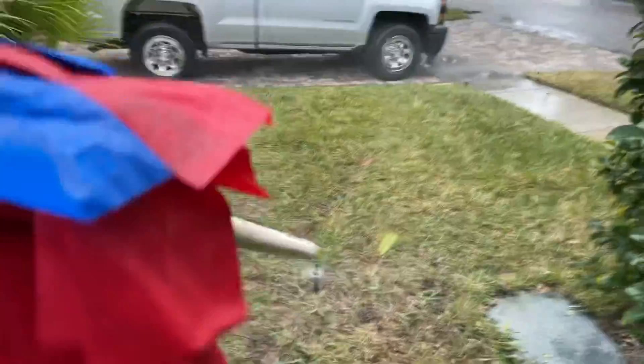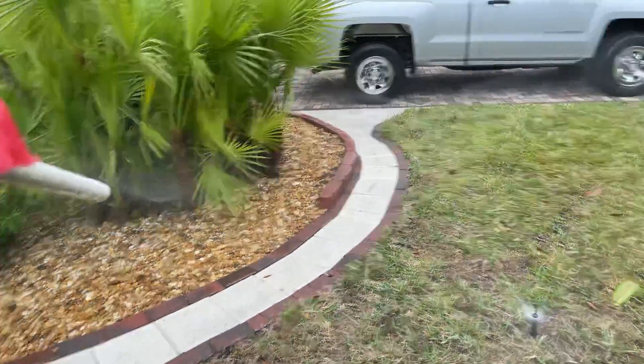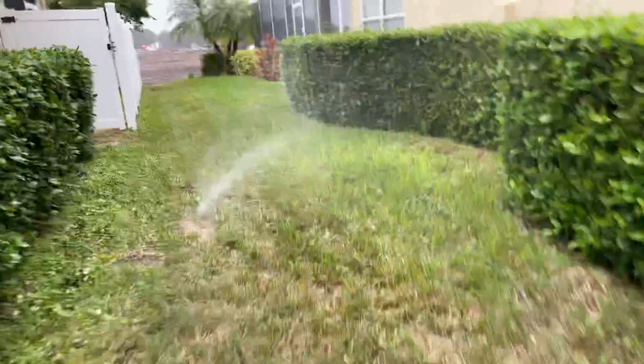What I would do is keep that one there and cap the one in the flower bed — there's no need for it, you have plenty of water going into that flower bed. It's a recommendation to cap that off. So we have two cappings on this zone. Then we have this one here which is fine — it's getting coverage. This one's perfectly fine getting coverage there too.